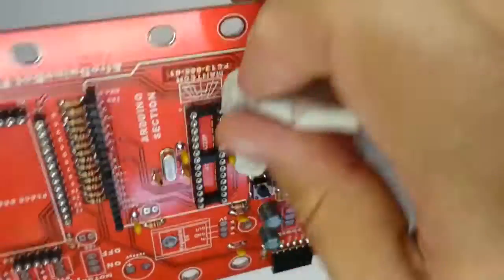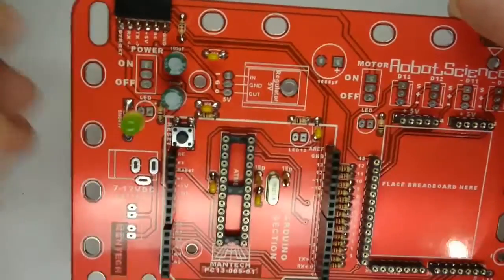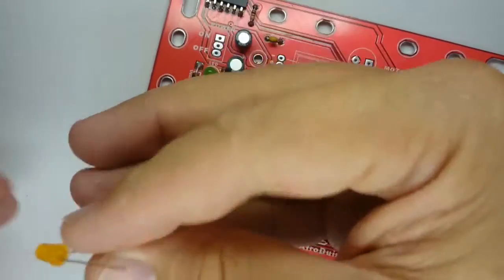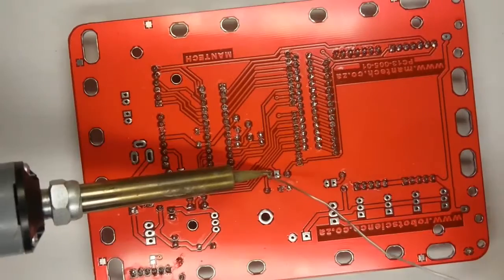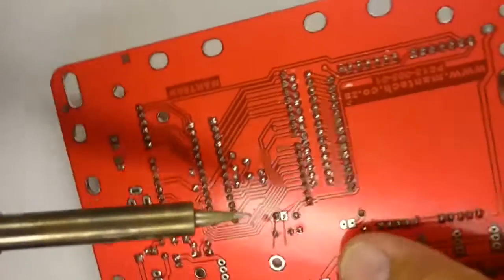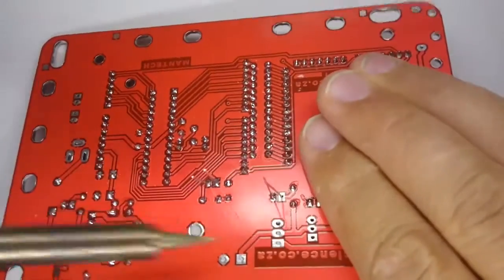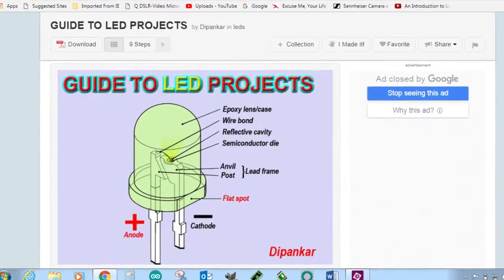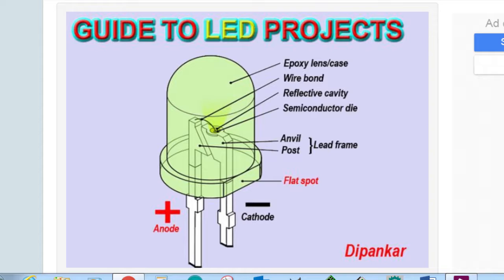There are three LED indicators to be mounted onto your Africabot Primo controller board. There are white silk screen LED markings on the printed circuit board — a circle with a flat edge corresponding to the flat side on the LED body. Fit the power LED which is green, the LED on digital pin 13 which is orange, and the motor LED which is red, with the short legs towards the flat marking side on the board. If you turn the LED over with the pins pointing up, you'll see that one pin is nearer to the flat spot on the base — that is normally the shorter leg, which is the cathode oriented towards minus. The longer leg is the anode oriented towards positive.